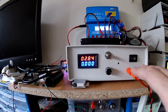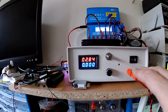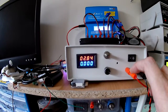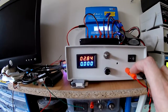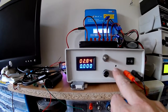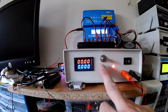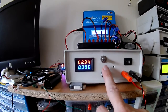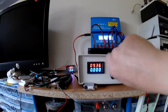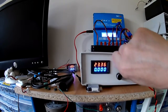I'm also going to look for a transformer that will just do the three-amp job. This one cost me 19 pounds but it's like five and a half to six amps, and the three-amp ones are nearly 30 pounds. I've got the little LED there that was on the board - I've got my current control, and of course we've got the full power - it'll go up to 31.6 volts I think.